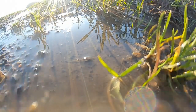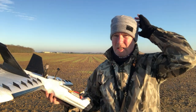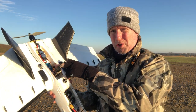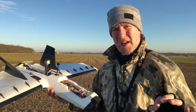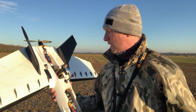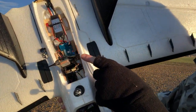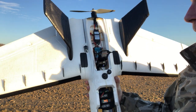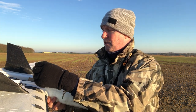I'm going to stop the recording and go retrieve the plane. That has brought this to quite an abrupt end. When I landed in that puddle, a little bit of water went into the front of the plane — not much, and certainly no water reached the flight controller right at the back of the fuselage. But now when I try to arm the plane, I get an INAV barometer failure in the OSD and constant beeping. I've never had a barometer failure before. I've depowered and repowered several times — I have a red light on the F405 wing flight controller, a constant red light with blue and green flashing, and the OSD just displays barometer failure. I can't fix it in the field.